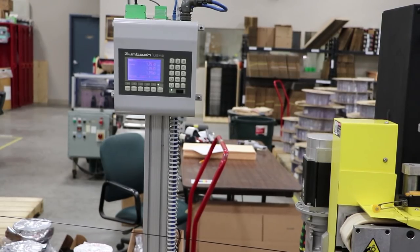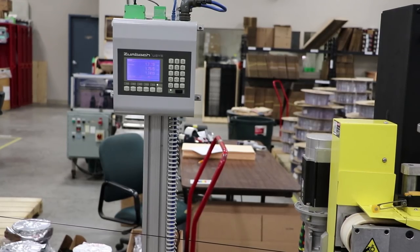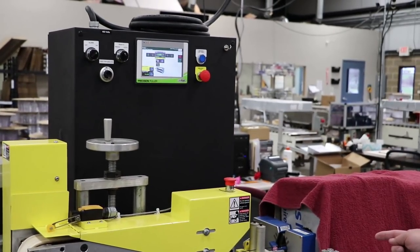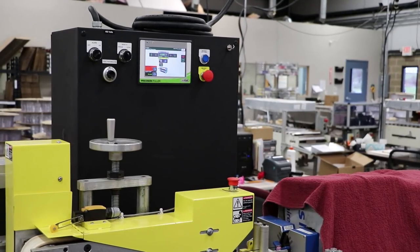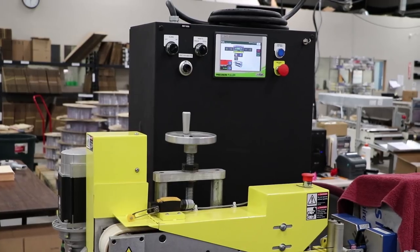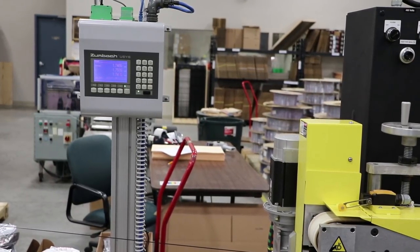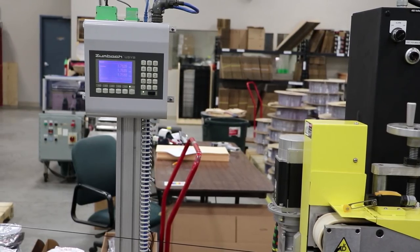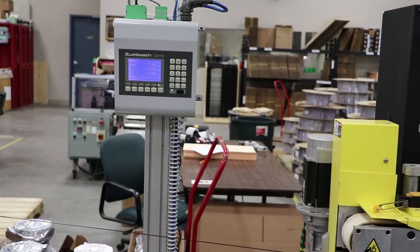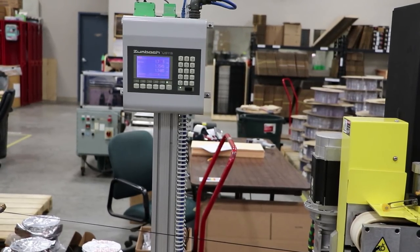On our line we've got a two-axis laser system that's actually measuring the X and Y of the filament as well as the standard deviation between the two. By looking at the X and Y, our tolerance is very tight. We advertise plus or minus 0.03 on 1.75mm, but I've got data to support 0.01 to 0.02 millimeters — very accurate material. This screen shows the tolerance in real time and it's measuring five points a second. That explains why it prints so well — I don't have to change settings in my slicer every five seconds.